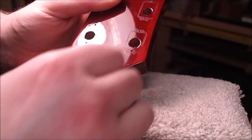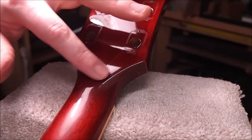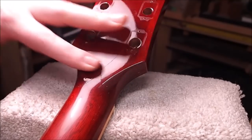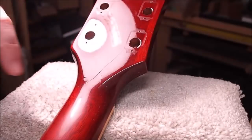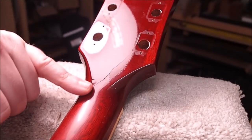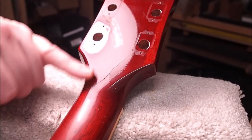Just cleaning up the glue residue. That sat down very nicely. I can still feel the cracks in the lacquer, of course, but the underlying form is very continuous - there's no major bumps or lumps. It's very good. There's one little divot here from the corner of the wedge, but that's probably going to get cut out when I do the splines, and if not I could fill it.